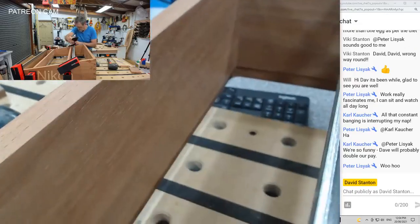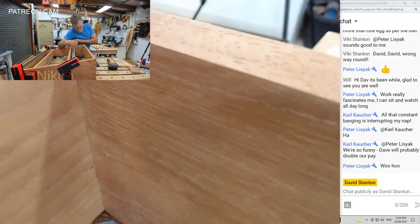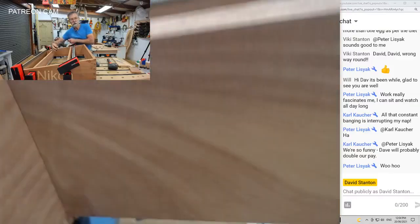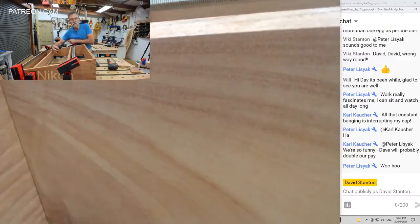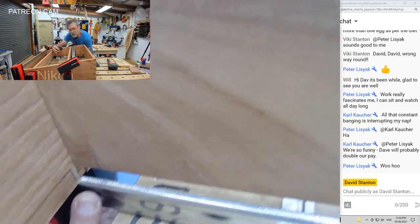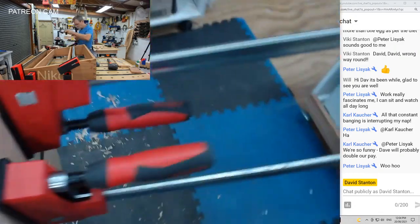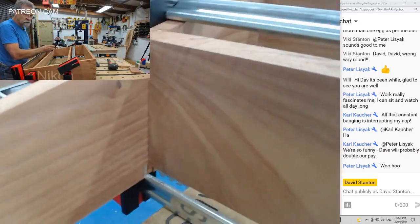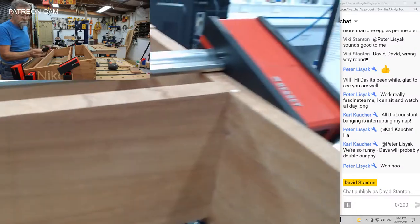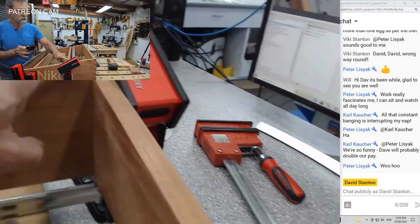That's by holding on to the inside of the joint and only putting glue, basically, towards the outside. Now you notice there's a little bit of glue down here. That's in the rebate. No one's going to see that. Down this side, and this is on the bottom, so I can come around to the other side. This is the top of the shelf where everything will be sitting. I will go around with a hand plane and just clean all of those off.